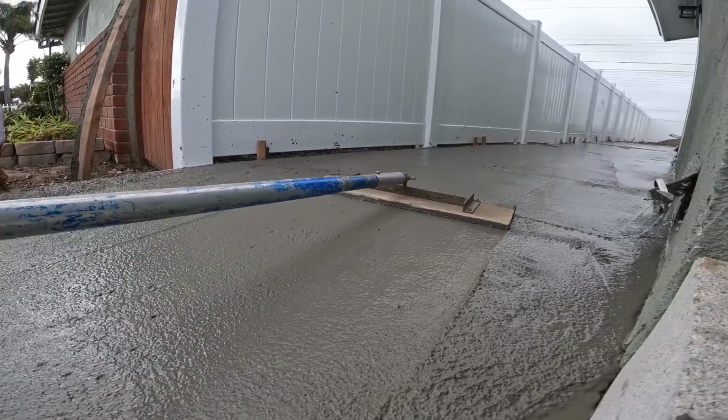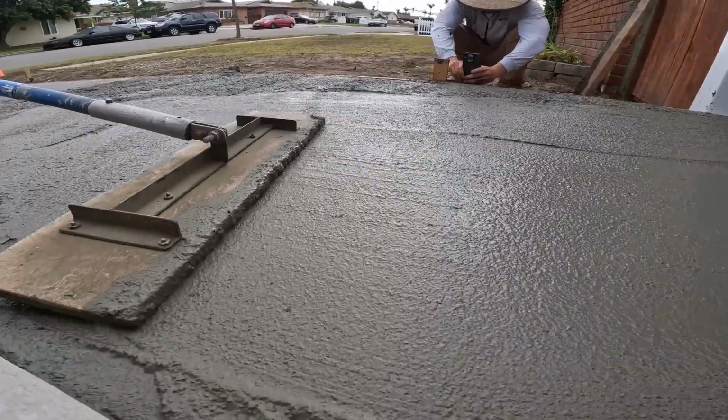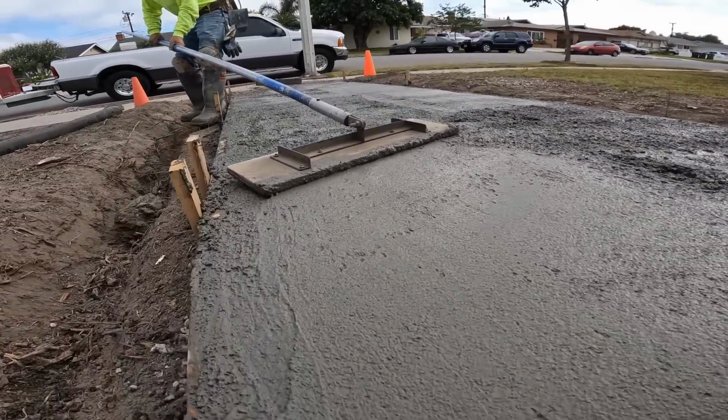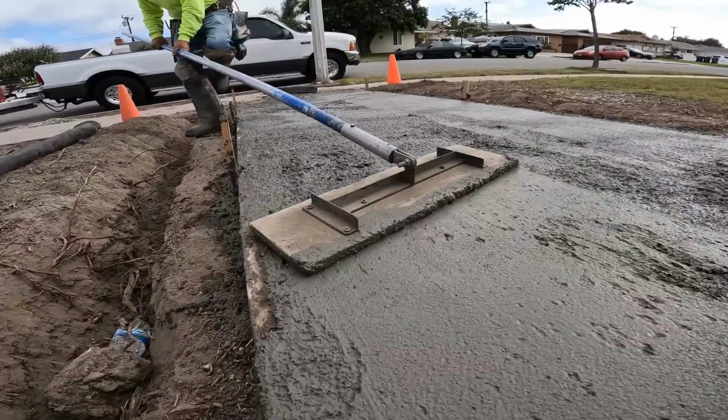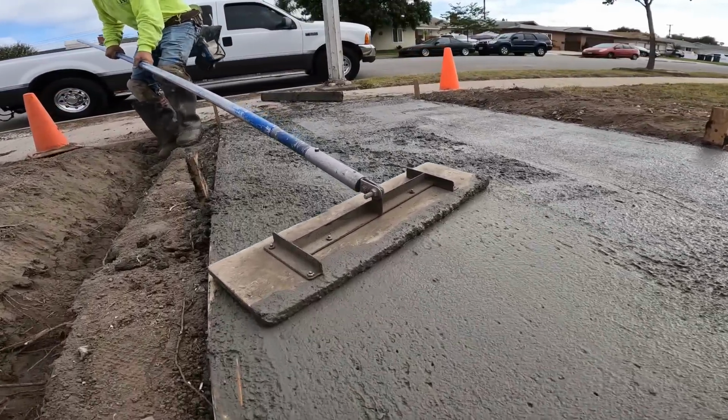Now if you had 1/2 inch rebar at 1-foot centers, then you'd want dobies if it was 6 inches thick. If it was not 6 inches, you really can't get it in there and make it fit. On paper it might work, but in the real world it doesn't.